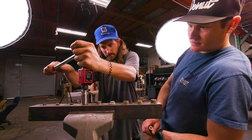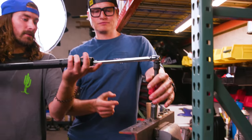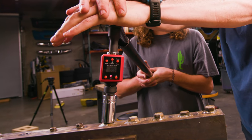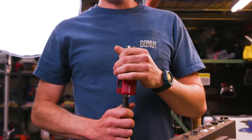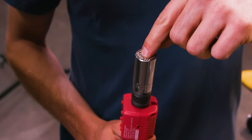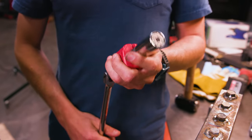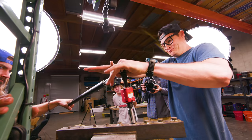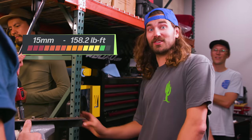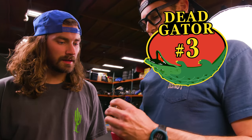On the 15 millimeter: 150... 158.2 foot-pounds. Heck yeah — all right, Gator! Though we got a little pin damage and bending there. Now I'm interested to see how it does on a 17 millimeter — might be a little in-between size. 90, 100, 120, 126, 130, 138 — hey! 142 foot-pounds. Honestly pretty similar. I was kind of surprised; I didn't think it was going to fit as well. And we really mashed this one — she's not springing back anymore. This is a really shallow head 17 — actually an old flywheel bolt — so the Gator Grip isn't going to have a whole lot to grip onto. We got 60 foot-pounds, 59.9.